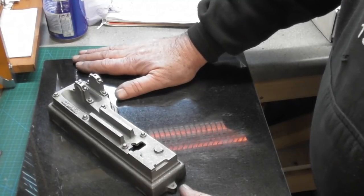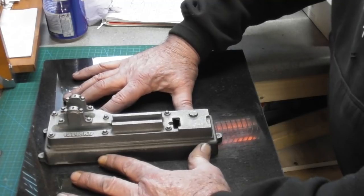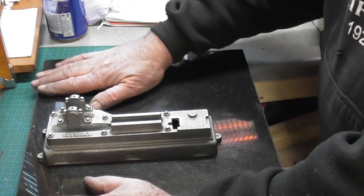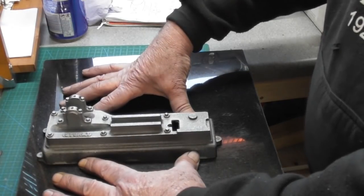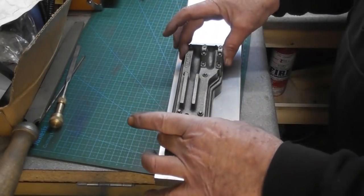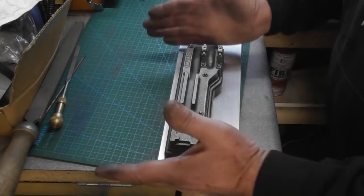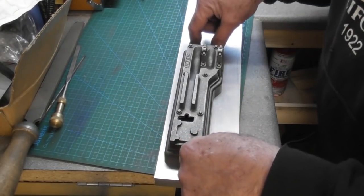I'm going to change from the plan slightly. A lot of people when they build these models mount them on a wooden plinth, but I'm going to mount this on an aluminium plinth. It'll probably have a couple of feet underneath so it doesn't scratch whatever surface it's on. I'm going to use the aluminium plinth as an aid to machining — that's where the aluminium plate comes in. My plan is to mount the base on this piece of aluminium, which will sit nice and flat on the bed, and then machine the outside of the aluminium square to the casting.